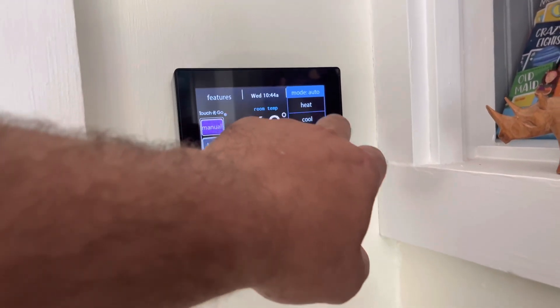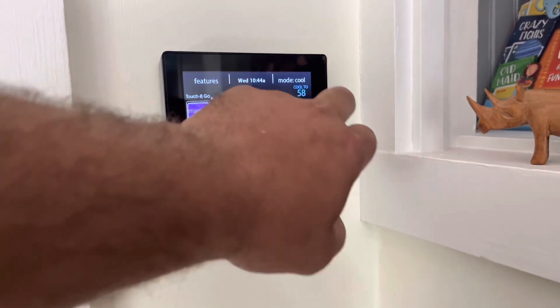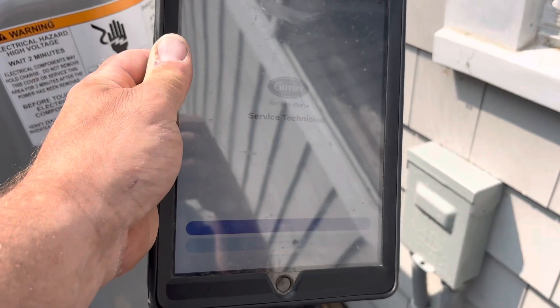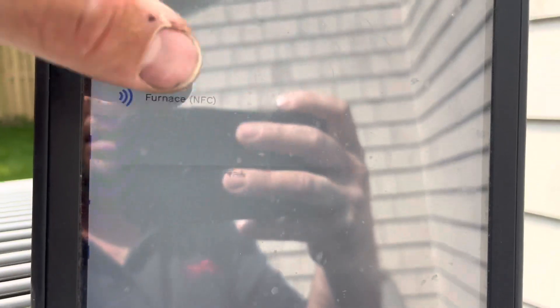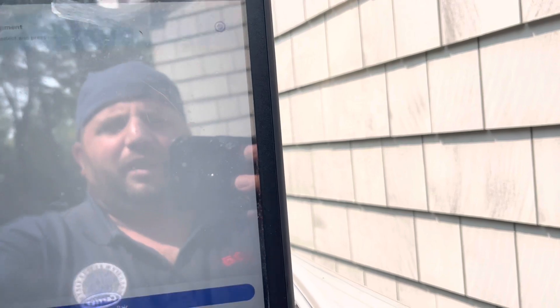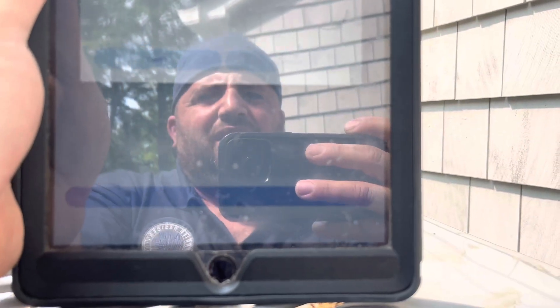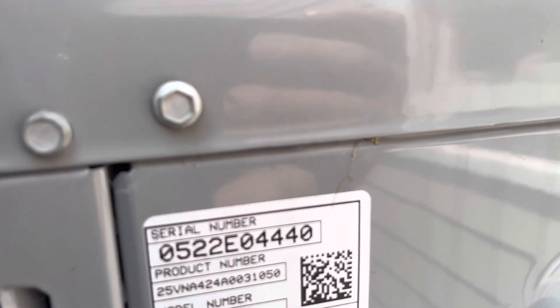So here's the user interface — I'm going to put this to cooling. My service tech app for Carrier, sign in, and then you want to connect to the outdoor unit or the furnace, which is right here. Outdoor unit Bluetooth — see if it searches, new equipment, select and pair. I only want to pair it right here. And then it gives you your model and serial number that you're pairing to, and you go ahead and cross-reference it and continue.